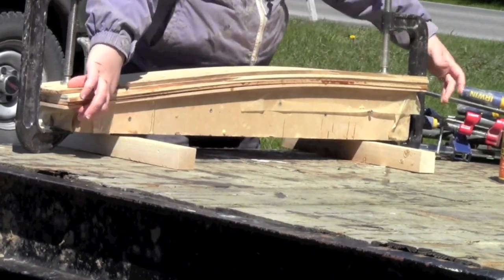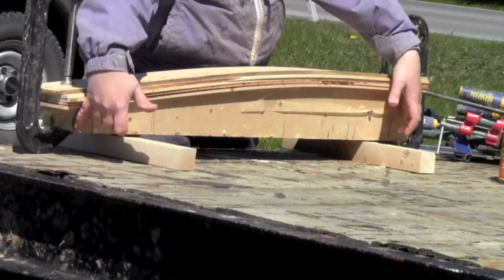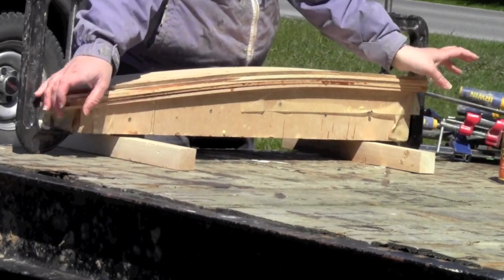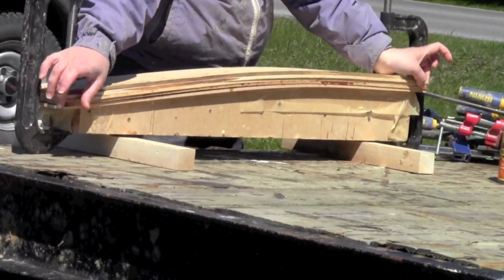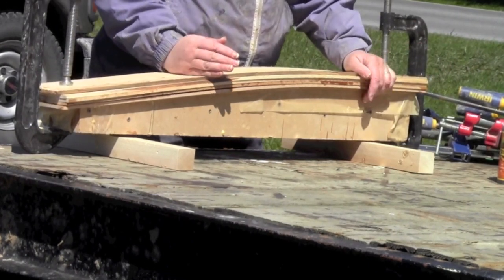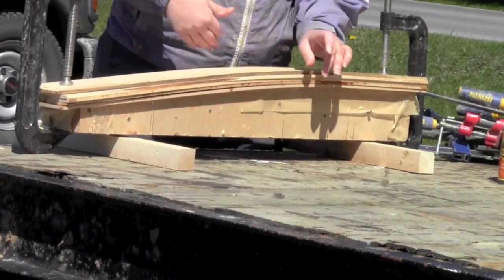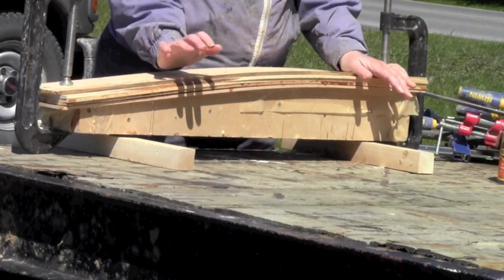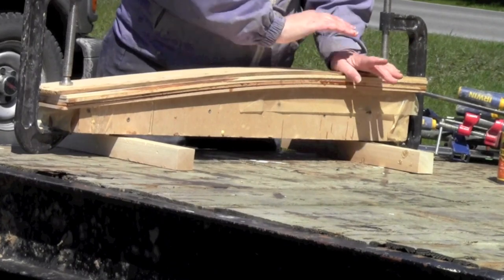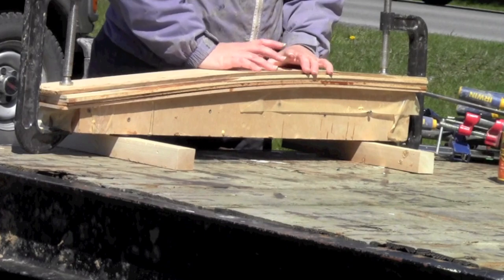You'll notice there's an overhang on both sides. The actual arm is only this long from the beginning to the end of my form. This allows for misalignment of the board so they stick out a little more and don't line up perfectly — I cut them off with my chop saw. Also, it sticks out on either side of the form. When it's all glued up in 24 hours, it's going to be put onto my jointer — one side is going to be made flat — then run through my table saw until it's four inches thick.